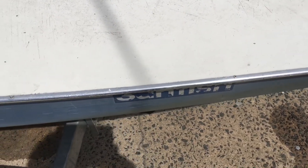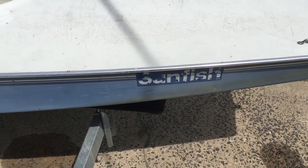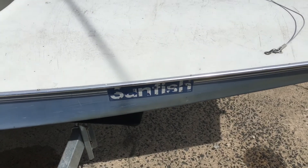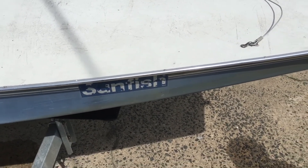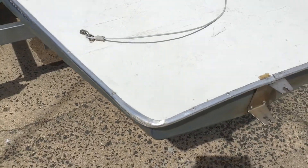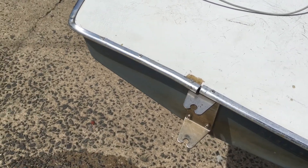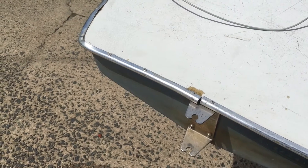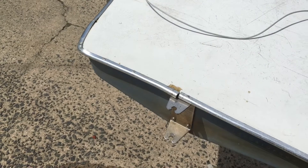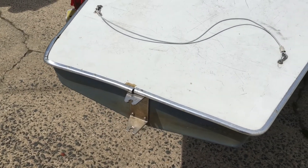We'd also put some 5200 on top of those pop rivets. We can go from right here where it says Sunfish with the bead of caulk around to the other side so there's symmetry to it, or do the whole boat — which I think is a waste. Instead of opening up where it was fixed before, we'll just encapsulate all that. To take the aluminum or stainless off opens up a big ball of wax, so we won't do that unless you specifically want us to.